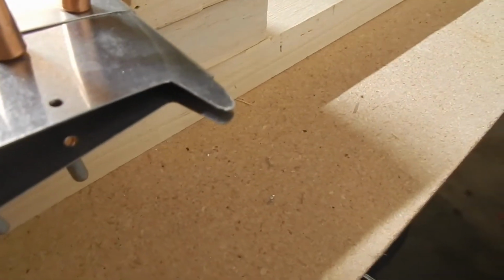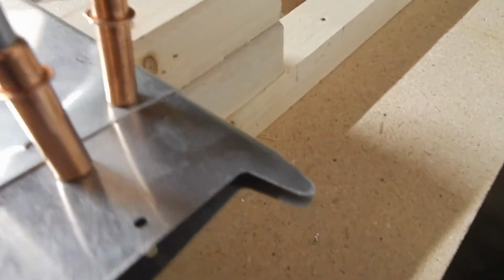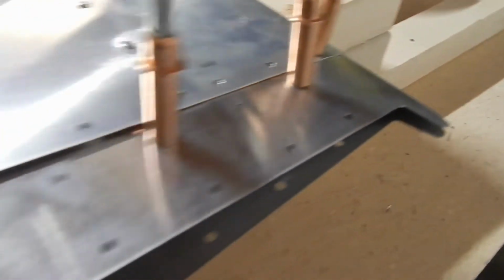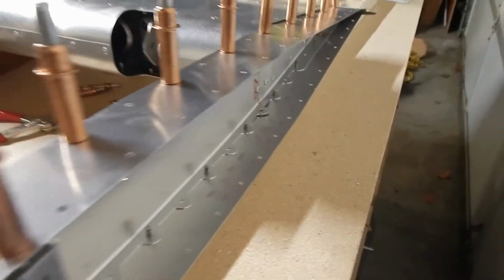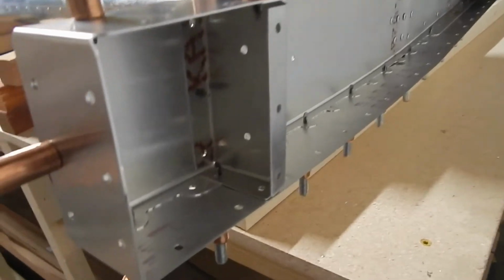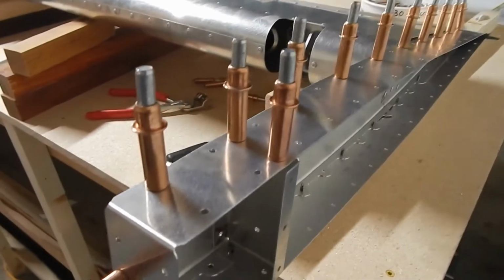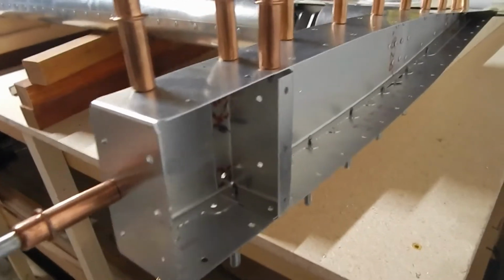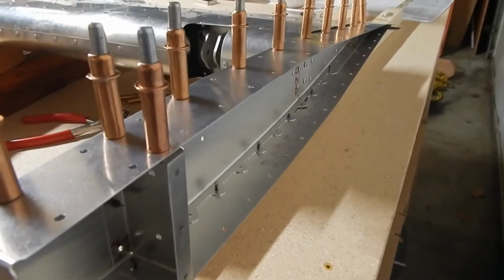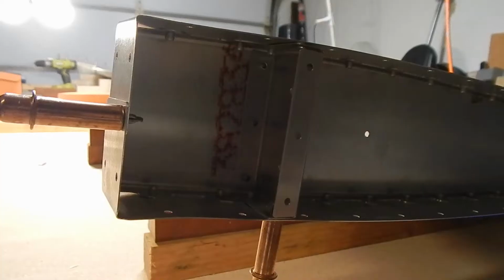These tips, they don't mention taking the tabs off, but all the other skins, we've taken these tabs off. So I will cut the tab off, as I watched a video of someone else and his tab is gone, although the manual doesn't tell you to do it, but it's common practice at this point. Then they want some epoxy inside here and some BBs or lead shot for counterweight, which is going to go in there somehow, which we'll figure out as we get further down the instructions. So this is just getting the pieces put on and clecoed, and then we'll work on the other end after we figure this end out.